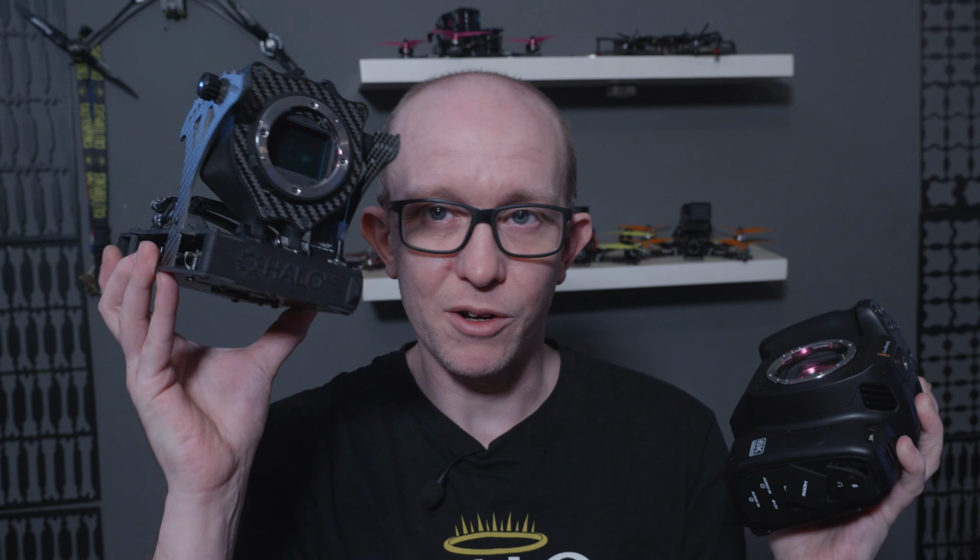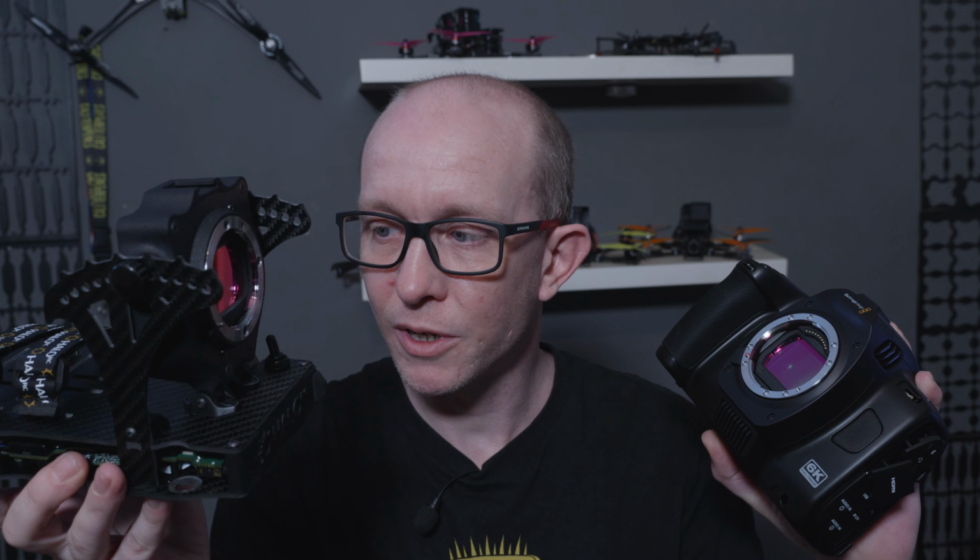So today I'm really pleased to announce my new product, which is a new Naked camera, a new Naked Blackmagic camera, the new Naked Blackmagic Cinema 6K full frame. So I've taken one of these, Blackmagic Cinema Camera 6K full frame, which weighs 1200 grams, and I've removed absolutely every bit of weight from it that I can, converted it to Sony E mount, and reduced the weight all the way down to just 500 grams, which with such a huge weight saving just makes it much easier and better for putting on a drone, because weight is everything when it comes to flying a drone.